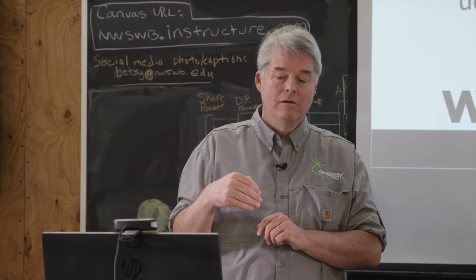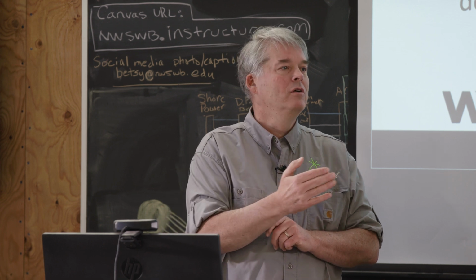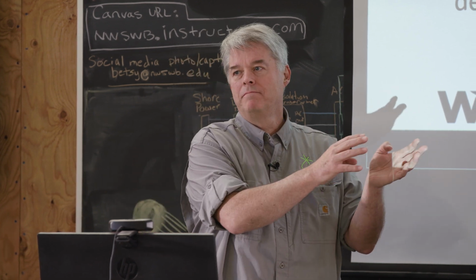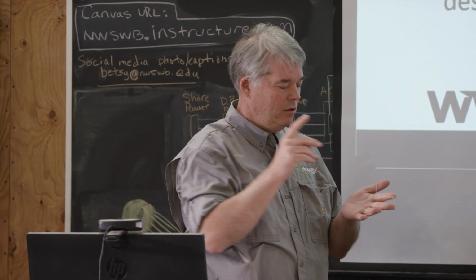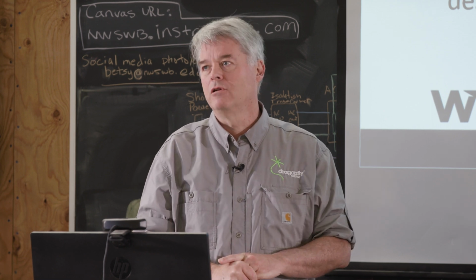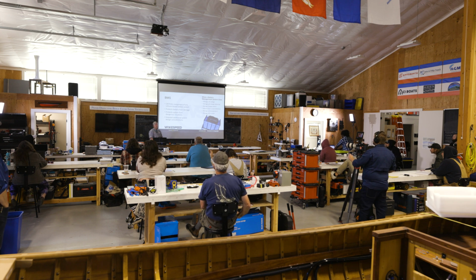A second thing a BMS can do is that some of them have the ability to communicate out. They can say, stop doing that. Or they can say, keep doing it, but only do it this much. There are different levels of communication in and out, and we'll cover the variances when we talk about legacy connections with a Wakespeed, or what I call a wiggle wire, where you have a charge enable, or if you have CAN bus communication with the BMS. Each of those provides a better ability for the charging subsystems and the battery to communicate and provide the safe values that we're looking for.